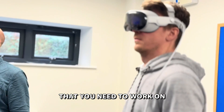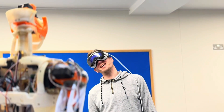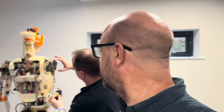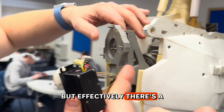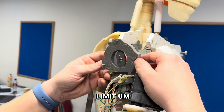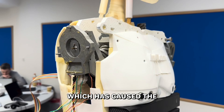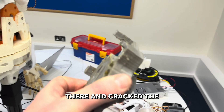There's a mechanical issue — we've experienced a catastrophic failure in the shoulder. There's a potentiometer, which is normally inside a servo but is outside the servo in this case, and it tells the servo when to stop when it's reached its limit. There was a screw missing on the lower portion of the potentiometer, and failure there caused the servo to keep turning, which has absolutely destroyed the worm gear and cracked the gear casing.